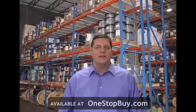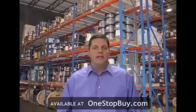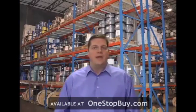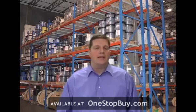Type-G cables are constructed of flexible, stranded bare copper conductors, an EPDM insulation, and a CPE rubber jacket. These cables are UL listed, MSHA approved, and carry a 600 to 2000 volt rating at 90 degrees centigrade.